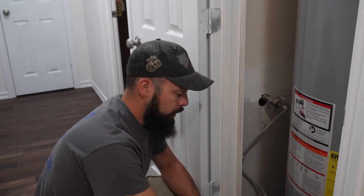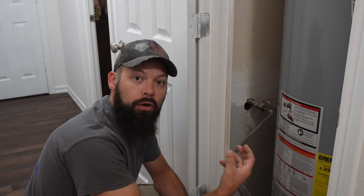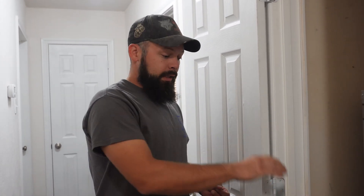We also like to let customers know that on your air handler up in your attic on your AC system, we like to do a flood sensor up there as well. So as soon as water hits the pan because your drain is filled up and no longer draining out, it will actually kill the system before starting a flood in your house. Because when this happens, it's very sudden and abrupt, and then everything hits the fan as soon as all that water hits the pan.